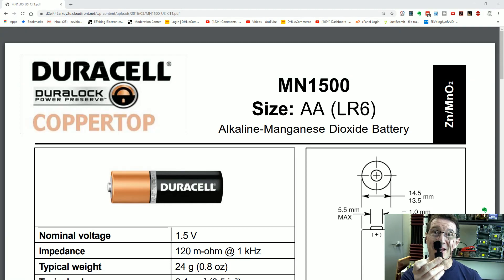The difference from last time is I just had battery holders with one half-discharged and one fully-discharged, because I thought reverse-charging one of the batteries might have done the business. Some cells did actually reverse voltage — that is a real thing — but none of them leaked. The problem is that load was too low; it didn't allow pressure to build up inside the battery and cause leakage through the rubber seal on the negative terminal.